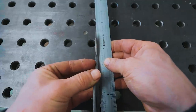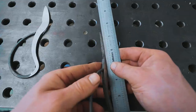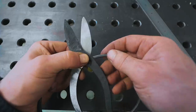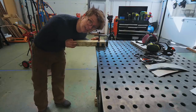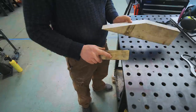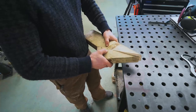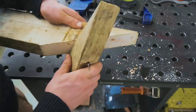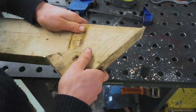In the end, we're going to hammer a hollow into here so they force themselves against each other. But how we prep our pivot area is going to be of importance, because the angle at which it wants to pivot is going to be affecting things. Right now, our pivot area is sending things into a taper towards the tip. We've got to work out: is the taper towards the tip going to be good, or as we pivot, will that actually accidentally open up the tips? I don't fully understand how this is going to work, so we're going to make it in 3D.